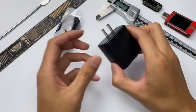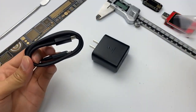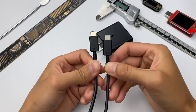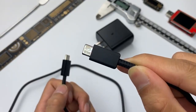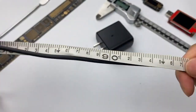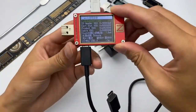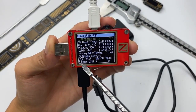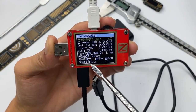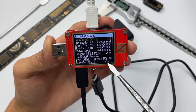Next, let's take a look at the cable inside the packaging. It has dual USB-C ports and both ends are marked with 5A. The other side is marked with Vietnam, and the length is 1 meter. Using the ChargerLab PowerZ KT002, we can see it's a passive cable with an E-Marker chip inside. It can support 100W charging but only USB 2.0 data transmission speed. The 1m length is confirmed.